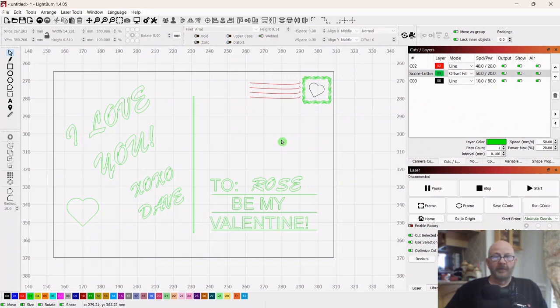Let's see if we left anything off. No, I think we're good. Over to the right you cut some layers — always be sure that your engrave layer is above the cut line, because often I've forgotten to do that and then it'll cut first and then try to engrave and it just makes a mess. Okay, let me cut this out and we'll see what it looks like. Okay folks, be back shortly.